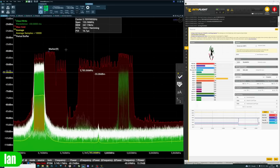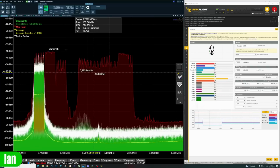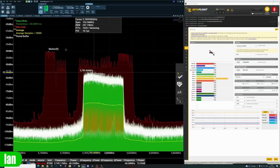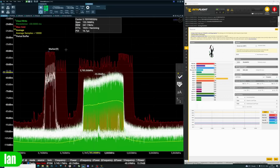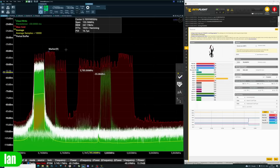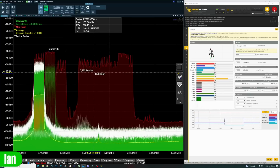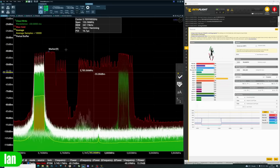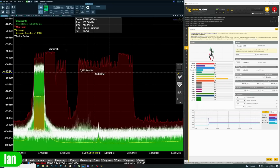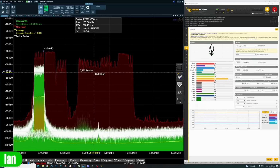And what you've then seen is the video link drop, and then the carrier move and drop down to the thinner standby carrier, which is waiting for the goggles link to reconnect. What's interesting is where you see the point of the large O3 carrier in the middle of the Spectrum screen drop and change, you see the remote link stop as well, but then a few seconds later, the remote link itself recovers. On the remote side, what you had was a couple of beeps to say that the signal had dropped, the LED started to flash, and then a reconnection beep after that 5 seconds.